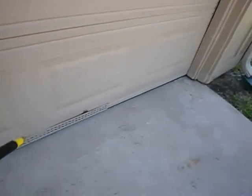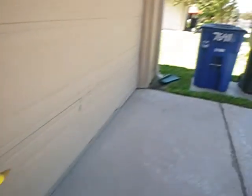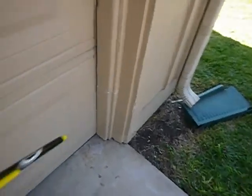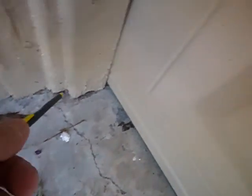Water discharges next to the ground. We've got a metal overhead car entry door and it looks like somebody's been running into it — there have been some repairs. This casement shouldn't be this close; it should have a gap underneath the vertical trim like the casement over there. They cut it off because it was rotting and replaced it — water wicked up inside and caused it to rot, and this one will too.